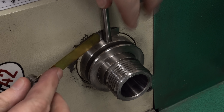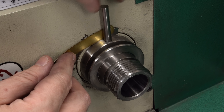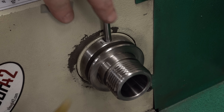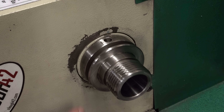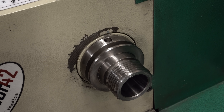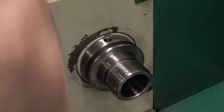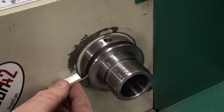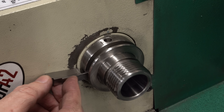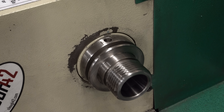The critical dimension, though, is how far that hole is from the surface of the headstock, and I can measure that with gauge blocks — the only one I can get in there is a 50 thou, and then I can use feeler gauges from there to figure out the remaining space. The other critical dimension is how thick I can make the block before it runs into something. I'll just stack gauge blocks up with a wear block on top and feel my way to an accurate dimension.